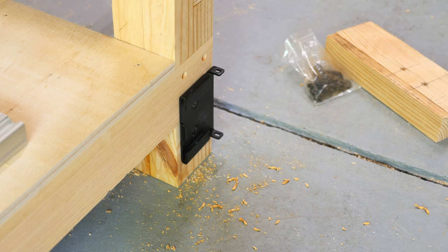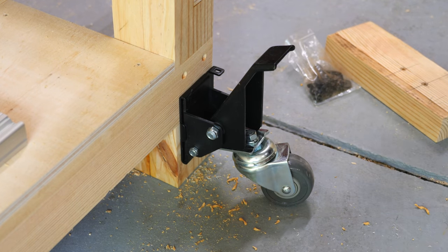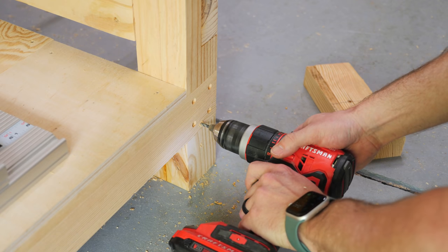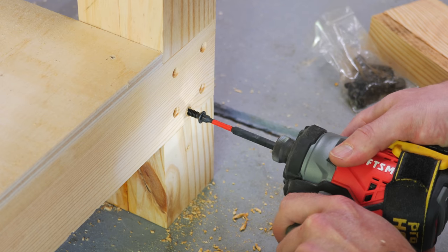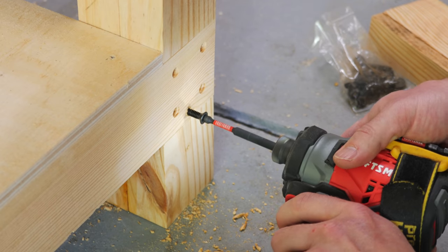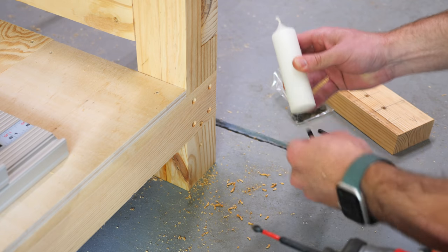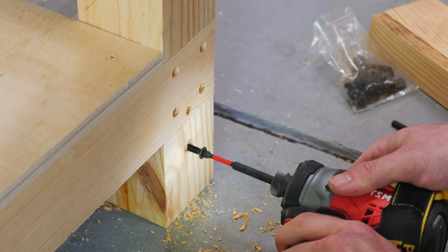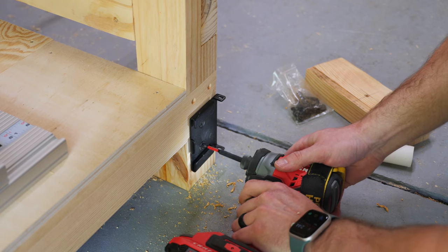The last bits of hardware to add were the mounting plates for the Rockler workbench casters I'm using to move this workbench around my garage. These plates are designed to be mounted onto three-quarter inch material, but my workbench legs are much thicker than that. Instead of finding different bolts — quarantine life — I decided to just drill the holes slightly undersized so I could essentially tap the holes with the bolts themselves. To help with this, I added some wax to the bolts before driving them in, which helped a ton and significantly reduced the heat buildup on the bolts. Once the holes were threaded, I could attach the mounting plates, and I actually think this solution worked great.